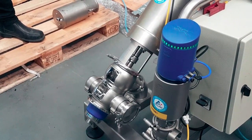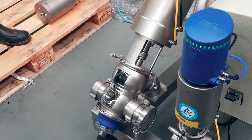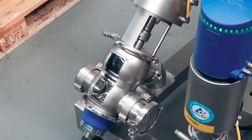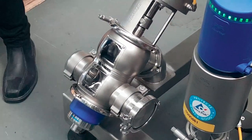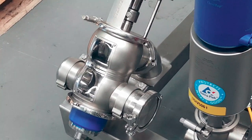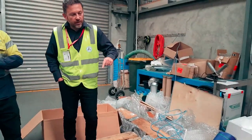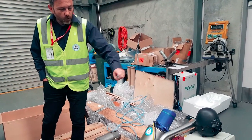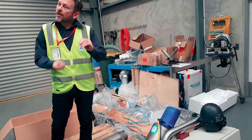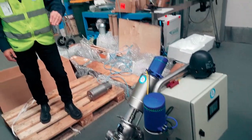And when it does that, that's where you get that spiro clean, eh? Because the tolerance between the O-ring and the body of the valve is so fine that it increases in velocity. The seals are really only cleaning when they're opening. If you open the valve fully, there's no velocity past the seal to clean them. So the beauty of these over the old generation is when you do a CIP function, the old one would energize, back to your HMI, validate, come back, and close. But that's all waste, so you're just running to waste, whereas these just go open, close, open, close.